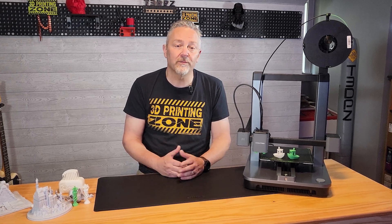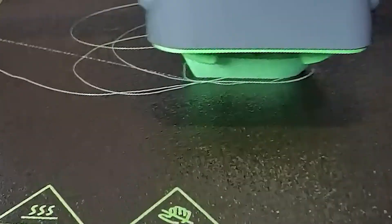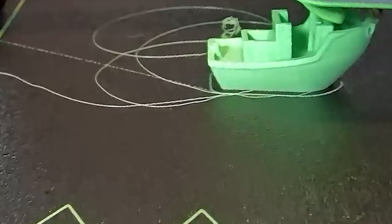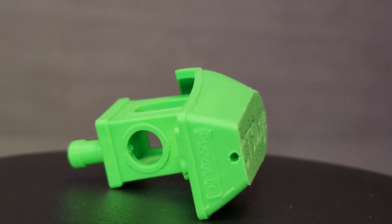Using the 0.2 millimeter nozzle with the preset precision mode at a 0.05 millimeter line height was both extremely cool and time-consuming. This Benchy took right at three hours to print — no speed records there — but the quality is amazing. You can barely see the layer lines on the sides, and even sliding my fingernail down the side barely showed any grooves.